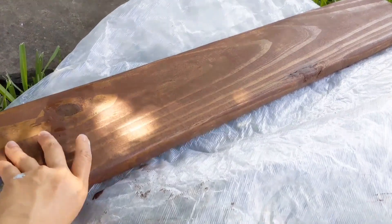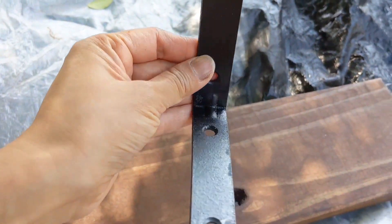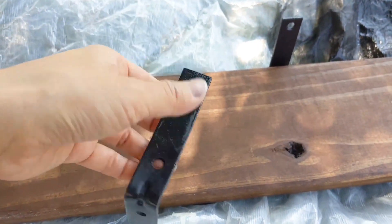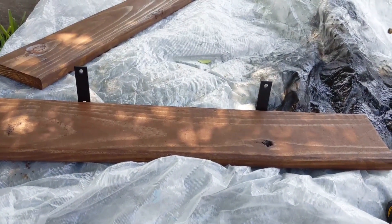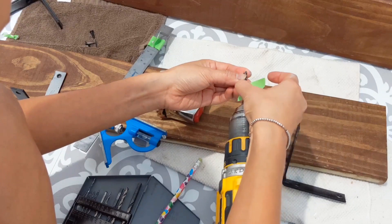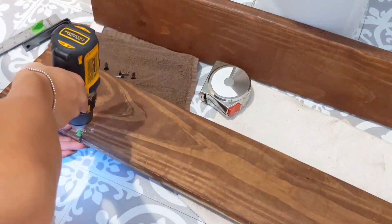Next we move on to the shelf above the toilet. At Home Depot, they have a pile of scrap wood that is deeply discounted — this piece of wood cost me less than $3. I asked them to cut it in half and I also bought some corner brackets, spray painted them black — less than $5 for four of them, which is perfect for two shelves. I used stain from a previous project to stain the wood, then once dry I pre-drilled the holes for the brackets. Quick tip: use the screw to measure the length, then use a piece of painter's tape to mark it so you know how far to go and don't drill all the way through.